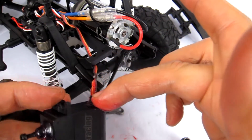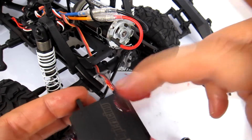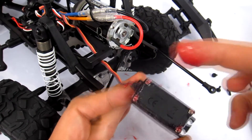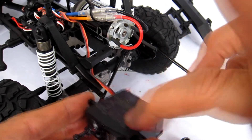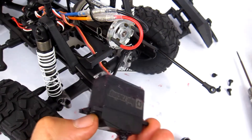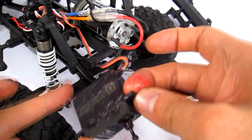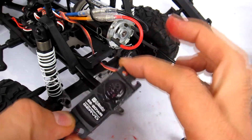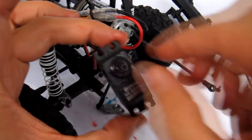This is not a guaranteed operation but it will greatly increase the odds of you not having any problems with water. There we go - that's the screw heads and the wires done, and now this upper join - just work it in. This is just a bit of extra insurance if you're waiting to upgrade completely to a factory waterproof servo.